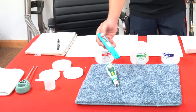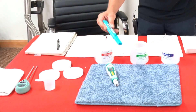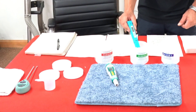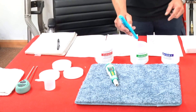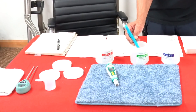I've turned it on and it's giving me a random reading in the air — that's probably from what I've done so far. I'll go ahead and stick it in here. As you see, the reading is increasing up to neutral, so that's pretty good. So while it is actually submerged in the buffer solution, I will hold the calibration button down for about five seconds.